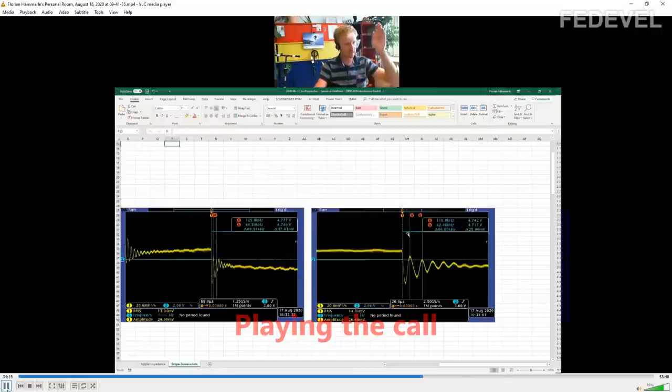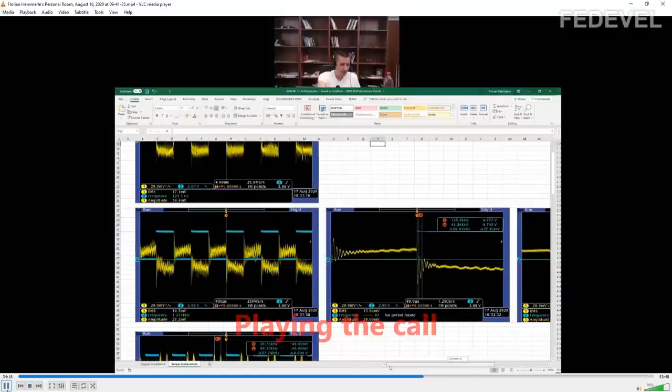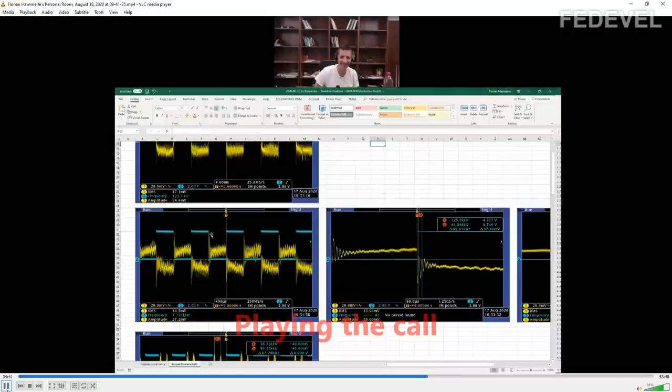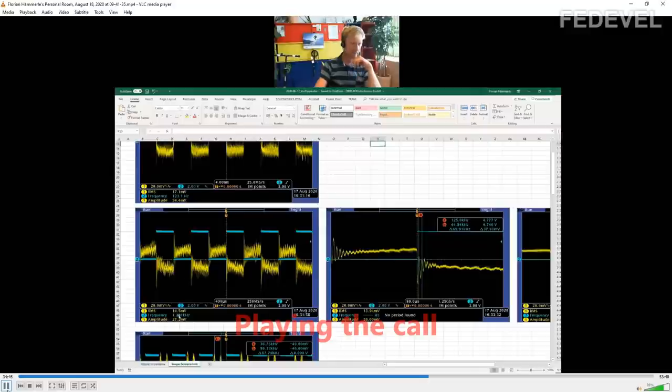So even at this 100 Hertz or 1 kilohertz, you can measure that you will have problems at 66 kilohertz. Because the edge, of course, is a step. The step contains nearly all the frequencies. It triggers the resonance, and the resonance rings. Wow, I didn't know that. The peak-to-peak result in that case shows 27, but that's just the main low frequency. The higher frequencies, as you see, is 20 millivolts per division, so it will be 20, 40. It will be already 80 millivolts, but just for the high frequencies.